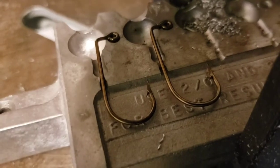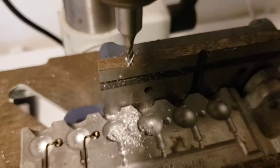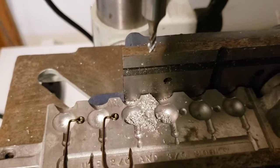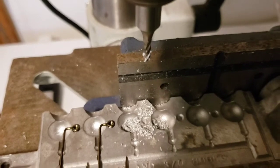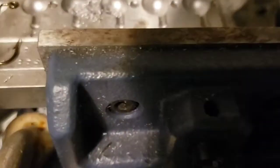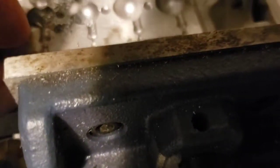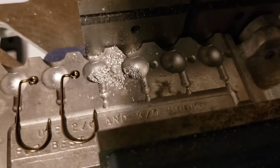I'll leave a link in the description for these magnets and the milling bit and stuff. Use an eighth inch drill bit, or pre-drill with a smaller one and then step it up to the eighth inch. You can go deeper than you need to because you just put a little bit of that silicone in the hole and then drop it in so that the magnet ends up being flush with what it was before, unless you want to go to a flat-eye hook — then you'll want it down just a little bit further so it leaves more room.